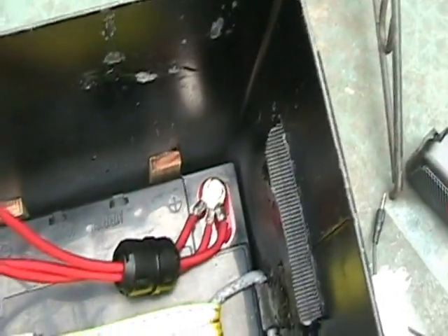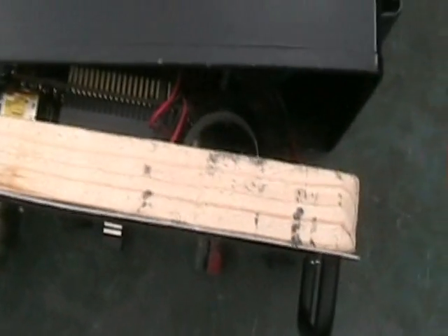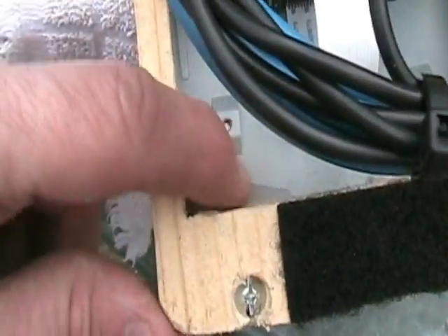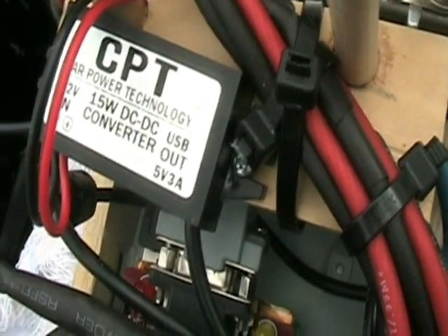I wanted to make sure that this thing was completely sealed — it's a really thin sheet of aluminum. Got screws right into the wood. I wanted to use a larger piece of wood because I had a lot of components down here at the bottom that were really close, and I wanted to make sure that everything stayed together real well. A lot of hot glue, a lot of Dremel work, a little Velcro to keep the front panel in. That's where I've got it hot glued into the display and to the wood. This is a three-amp unit — it doesn't draw that much for the display and all the other Pi and TNC, so it works really well.